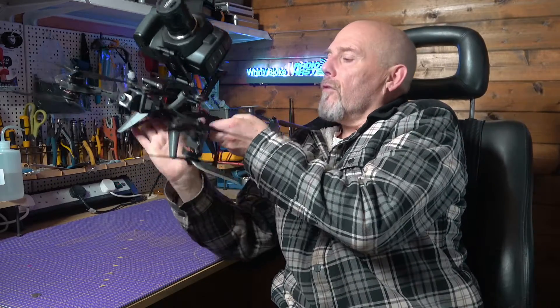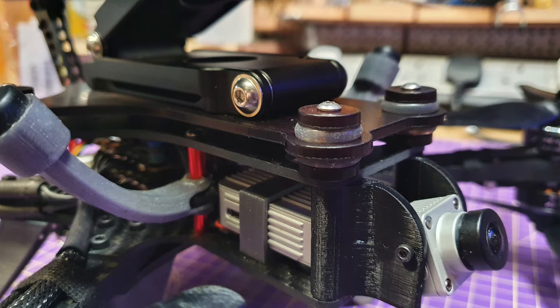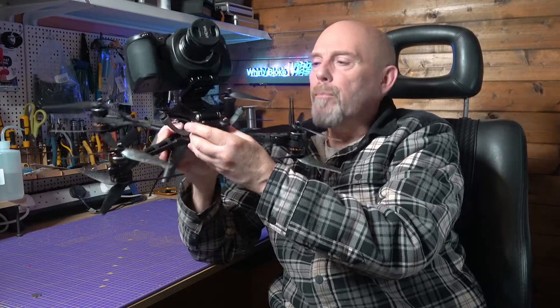Other changes made to the frame: there's now a new top plate to mount the camera, and this is mounted on these fantastic AlphaGel dampers. These aren't cheap — they're about $5 each, so there's $20 worth on this top plate alone. The reason you use AlphaGel is that their damping performance doesn't change with temperature. If you use something like silicone or TPU, when it goes cold they go harder.